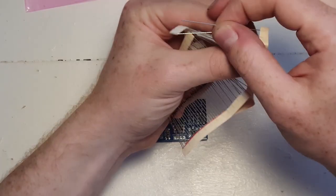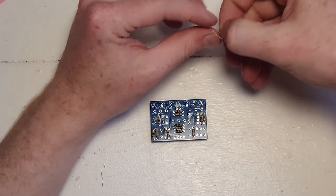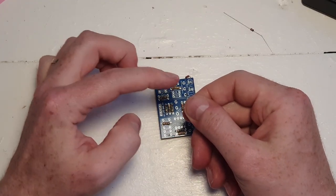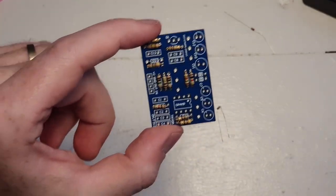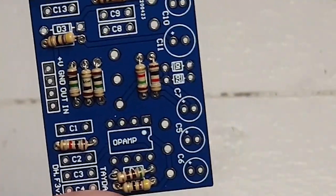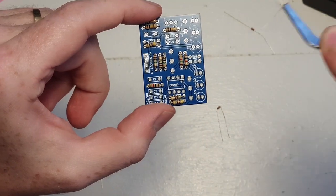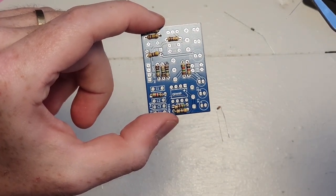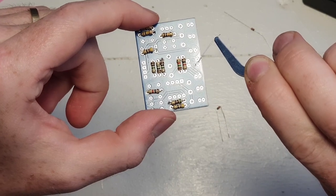If you were ordering parts for this build I'll provide links to the actual proper 1N914 diodes in the description. One thing you've got to watch out for when installing diodes is that the black band is generally indicated on the board itself. There is a band marking on the board which indicates where the black band of the diode should go — that band signifies the negative leg, or what we call the cathode. Just make sure the black band on the diode matches the band marked on the board for diode number one and diode number two.